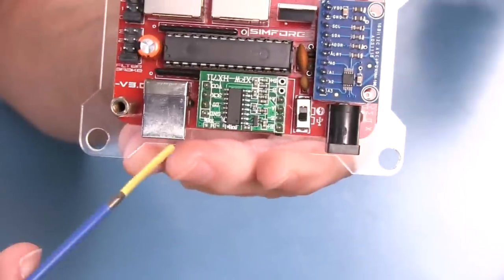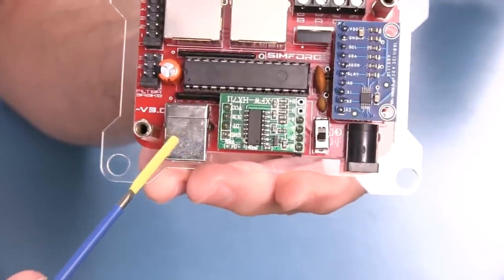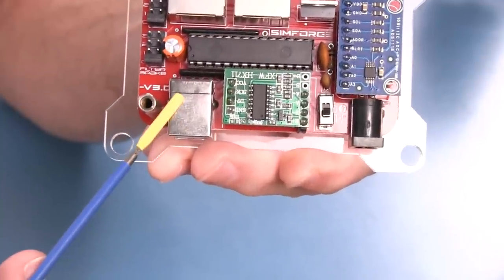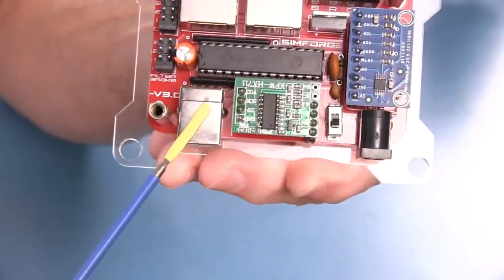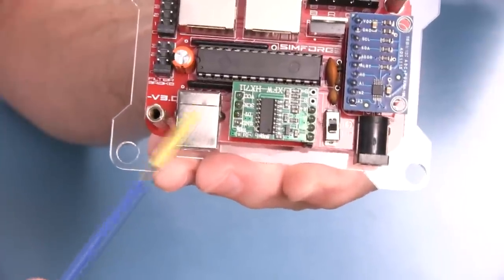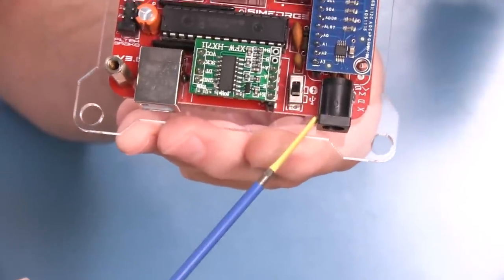So let's say I'm using a PC and the USB port, or maybe even a powered USB port, whatever the case may be. And I'm getting some noise on my pedals, doesn't matter which one at this point. So there can be interference or noise coming from the actual PC interface or powered hub interface that's causing some of that. So how do we get rid of it? Well, we simply take that current or that voltage off of this. We just shut it down, right? And then we'll go ahead and plug in an independent power supply over here, DC power supply.